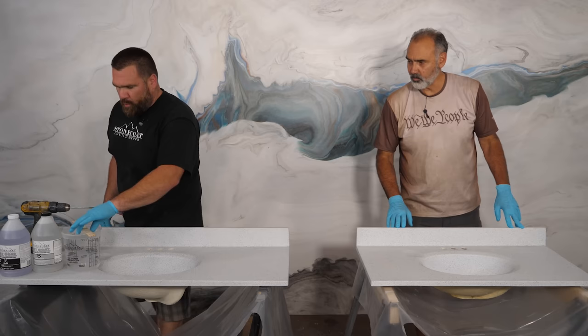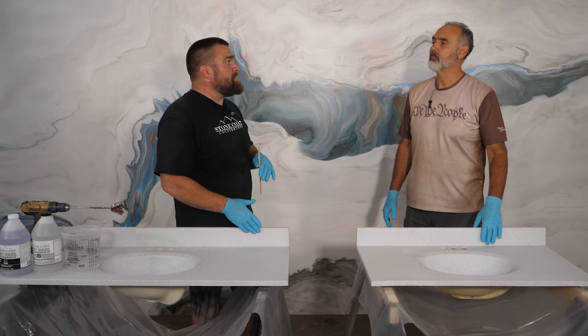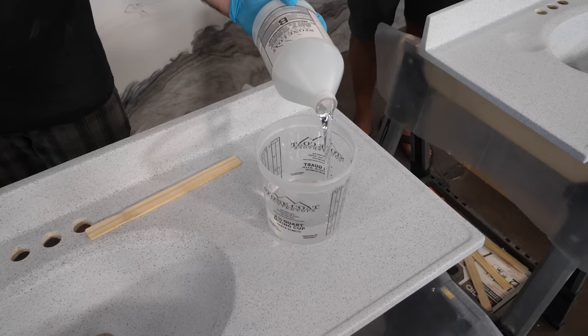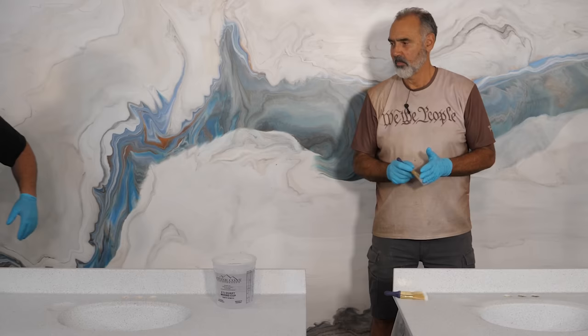The stone spray, if you're waiting on site, is about an hour to dry before you can mix up epoxy. We're going to go thinner coats — I want to do two coats. I'll probably mix up two ounces per square foot. The reason I do thinner coats on this particular epoxy technique is because of the backsplash — it's vertical, so it's going to be thin. Plus we applied a little texture, so to make a nice smooth coating, it's best to do two coats of clear epoxy before doing the ultimate top coat. No need to use the notch trowel — just use gloved hands.